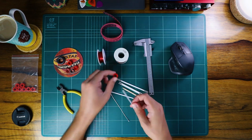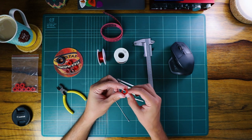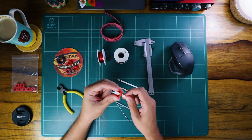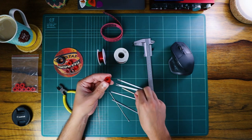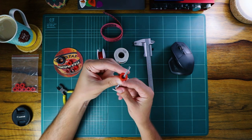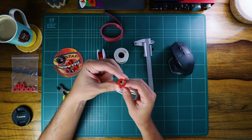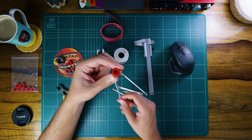To wrap the wire, we can improvise a 3D printed manual bobbin runner. You can melt a small hole in the 3D printed bobbin to hold the tip of the wire. Nice alternatives that I found were taping toothpicks or using another paper clip. The longer the device, the thinner the whole bobbin will be once you wrap the wire around, so it will fit a smaller hole as the transformer gets thicker.